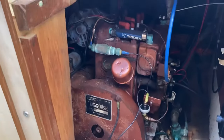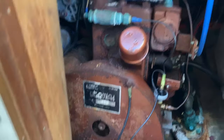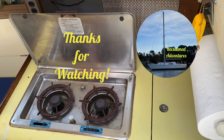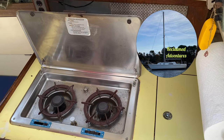So apparently it overheats. It's an atomic four gas engine. Preheat burner, open valve momentarily to fill priming cup, three-quarter fill with alcohol.